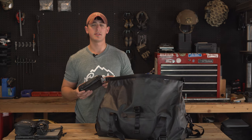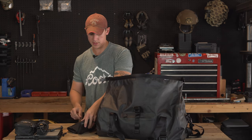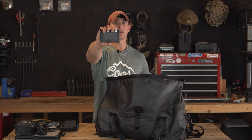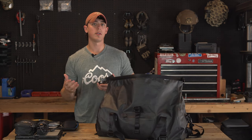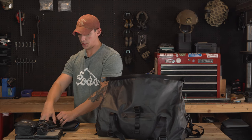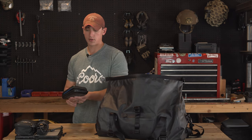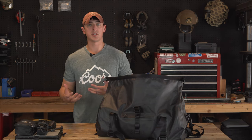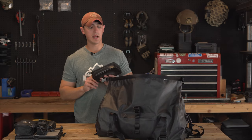A little more that you might want to do with cables and antennas is test the SWR of your antenna. What I have here is a Nano VNA from Amazon — it's not the most premium piece of equipment, but it's a great affordable tool to test the actual SWR of your antenna and determine if it's efficient for transmitting and receiving on your intended frequencies. Another great tool is the Bird SiteHawk — much more expensive but nicer, with access to more functions than the Nano VNA.